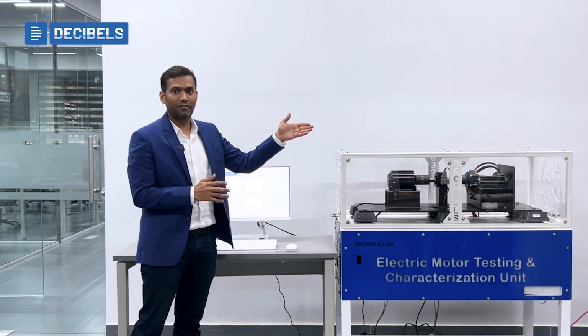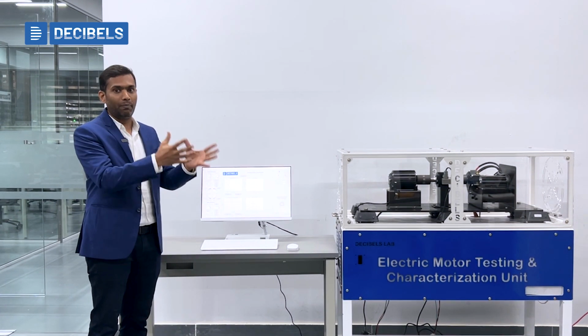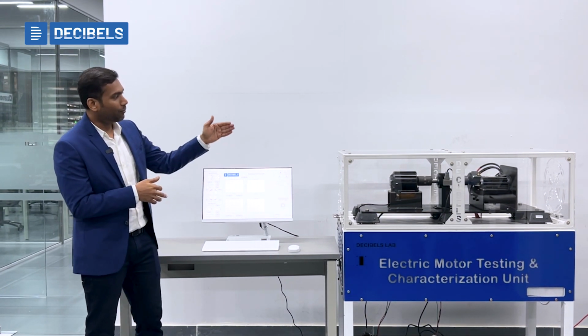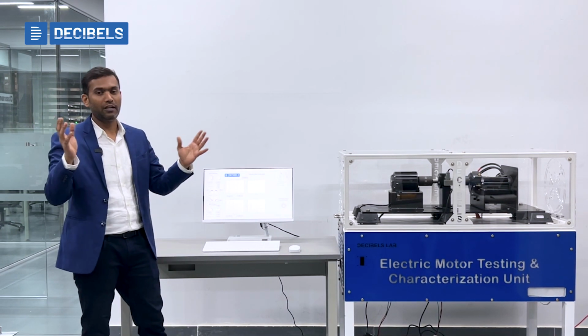And then, from those phase inputs to the mechanical output given by the motor, as we measure the motor speed and the motor torque, we will also be able to calculate the output mechanical power of the motor. Henceforth, we get to know the motor efficiency as well. When we subject the motor to different load conditions, we can get to know its efficiency at different ranges of speed and torque, and we can map the overall efficiency of the motor as well.